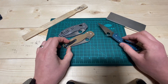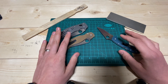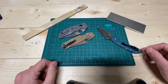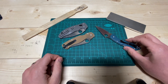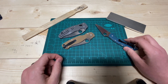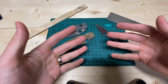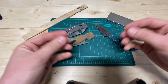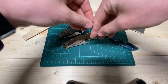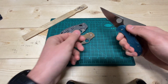The last note is the way that these steels break down. They're very hard and they do hold on to a finer edge for a long time compared to something like S30V, because these are just harder than S30V is ever run. They still do break down, though. The way they break down is it feels like the hard steel that surrounds the vanadium carbides — the actual steel matrix — seems to kind of retreat up into the steel and leave the carbides sticking out as serrations.